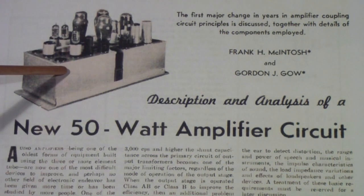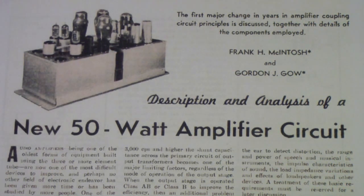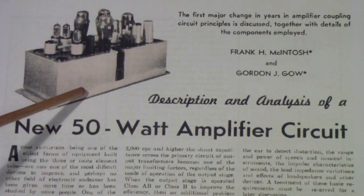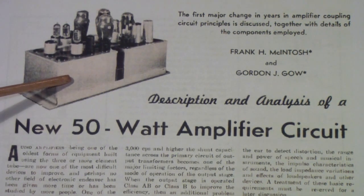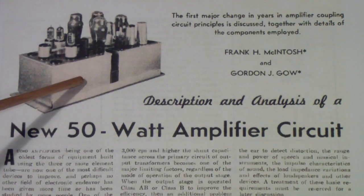At the top is a picture of an amplifier that McIntosh put out in 1949. It produced 50 watts, and you may notice it's a somewhat unusual design. Basically, all of the metal down here is transformer — all of the circuitry sits on top of these transformers. This was a mono amplifier, not stereo, so one of these transformers is the output transformer and the other is the power transformer. So what was McIntosh trying to accomplish, and how did he do it?